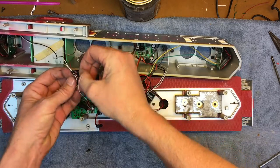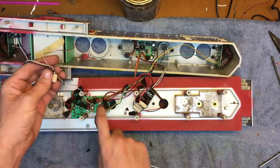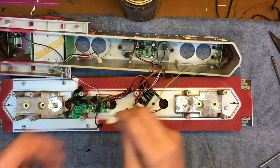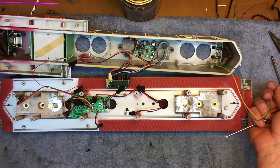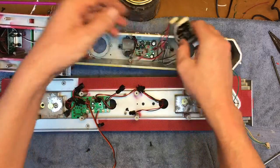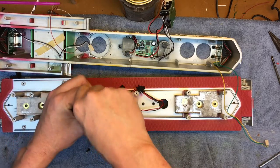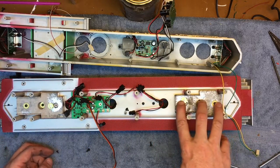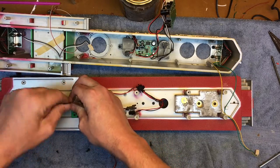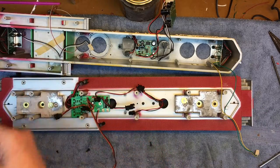If you're doing an Air Wire drop-in or wire-up, this process is actually going to be really similar. You'll take this board out, put the Air Wire board in, then reconnect the wires from the front cab to the Air Wire board and connect the smoke unit. The hardest part of the Air Wire install is running your trailing wire or putting your battery in the engine, making sure it's all secure, and possibly drilling a small hole to route the wire.